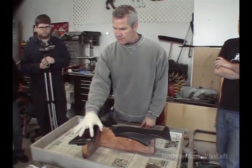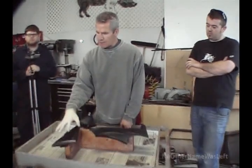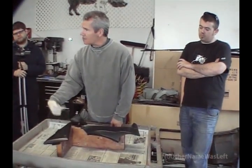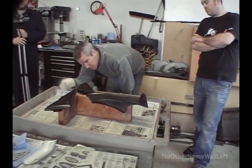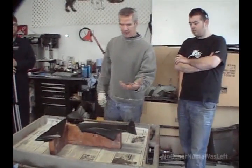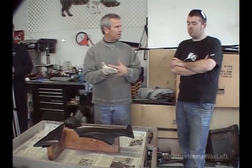But you can see that you couldn't take a mold off this and use it as a part. For starters, the outside of the part wouldn't have the right finish on it — it would be oversized. It just isn't going to work that way. So what we're going to do is make molds of these, so the inside of the mold will represent the outside of the part, and whatever you lay in and pull out will have a nice finish on the exposed surface.